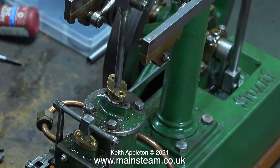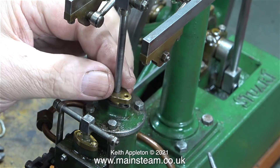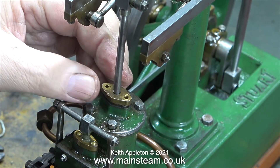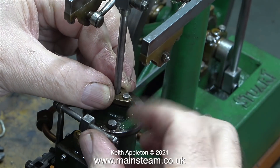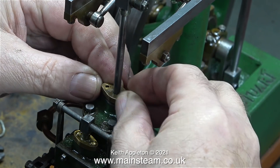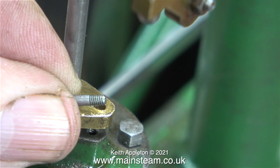That's why it was changed. When you pack stuffing glands on steam engines, if you use too much graphite yarn, the gland nut — or in this case the gland flange — needs to end up in the right position. For two reasons: the length of the bolts, plus if the top part of the gland nut is too high, it's going to collide with the part on the end of the piston rod. That's why you've just seen me unwind part of the gland packing and cut it off with a pair of cutters.